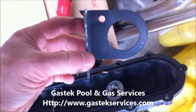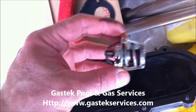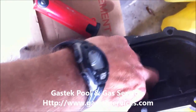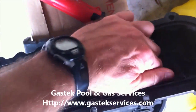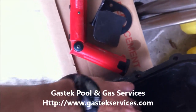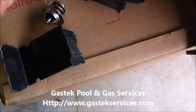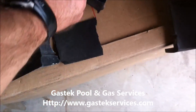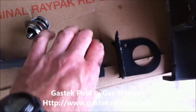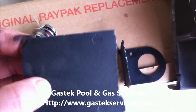As you can see, it's in pieces. There's a piece right there. Here's the thermostat that helps regulate the flow of the water, and here is the other piece — this one's stuck in there pretty good. See how that one just broke right off? See how thin that is — practically a piece of paper. There you have it — that is the flow diverter that manages the amount of water going in and out of the heater. You can see it's pretty thin; that's the way it came from the factory.